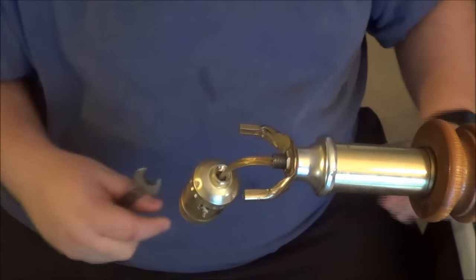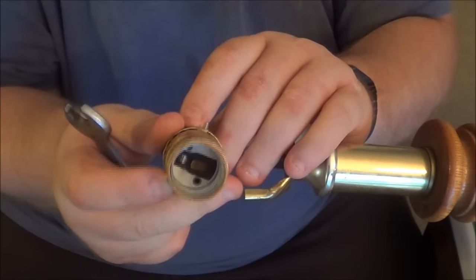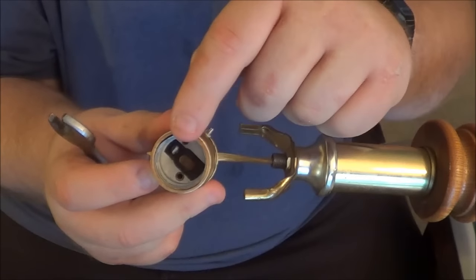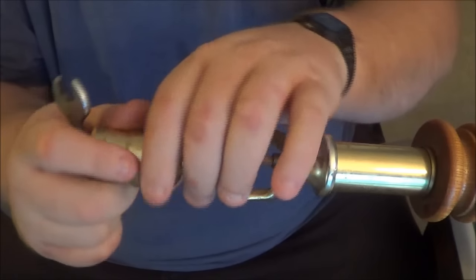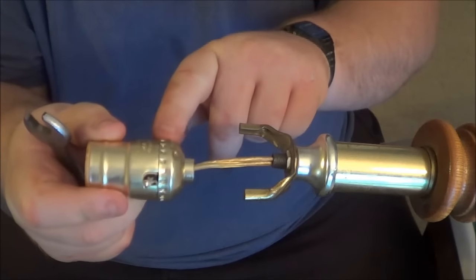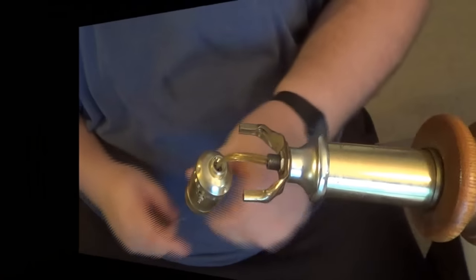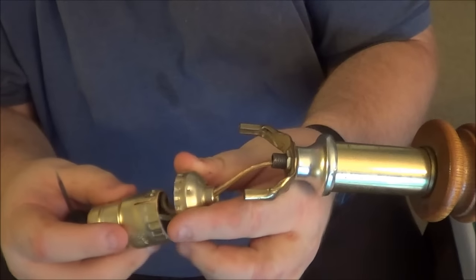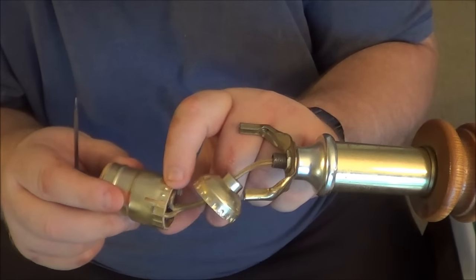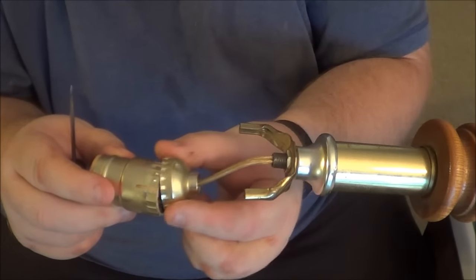Once you have this cleared out, we're going to have to take the socket apart. As you can see here, it looks like it's in fairly good shape, but you'll notice it's got the cardboard around it — I'm going to show you what this cardboard's for. The next thing you want to do is you might be able to twist these off. It's got a little cup that sits around it with an indentation. You may need to get a small flat screwdriver. Now we can take that off. You can see where my finger's pointing — they've got little indentations that allow it to grab hold of these pieces and put them in place.